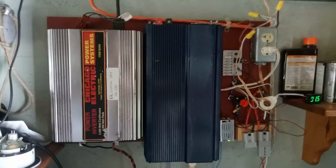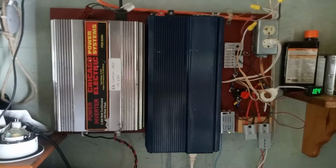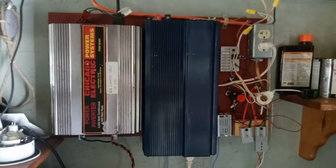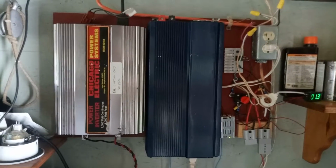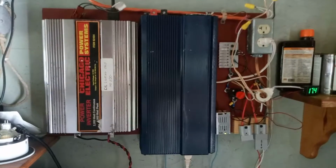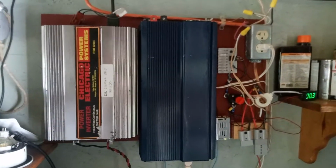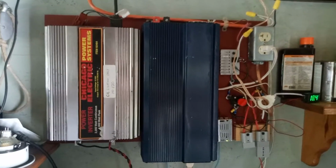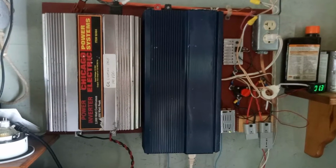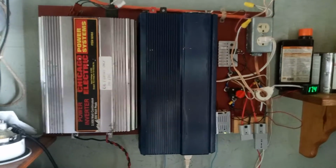And here's what I have. This is a 2,000 watt Harbor Freight. This is one of the older ones. And I bought a whole bunch of these, and usually, one portion of the H bridge has some shorted FETs, and I don't even bother replacing the FETs. I just wiggle out the shorted ones because they're doubled up, and they work. 1,000 watts then, but that's more than I usually need. So this one I bring out wires, so I'm feeding the high voltage capacitor with around 145 volts, and I supply 12 volts to the control electronics to keep that alive. That's only about 50 milliamps.